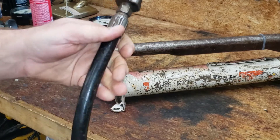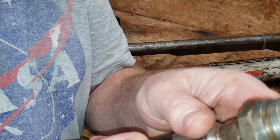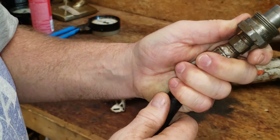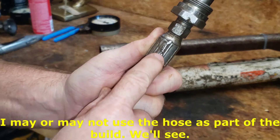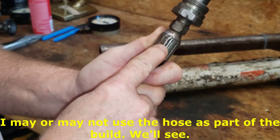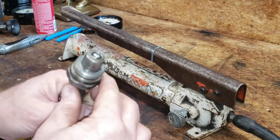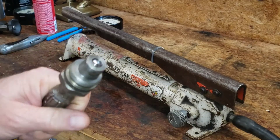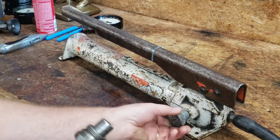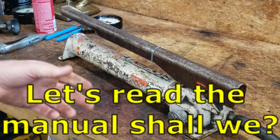This hydraulic line is really substantial. It says on the line: made in the USA, EF, 10,000 PSI max, and the part number looks like 9798. It also looks like there was a leak here and somebody brazed it — or maybe somebody just bumped it with their welder. The hose looks like it's in pretty good condition, but there's some seepage at the hydraulic end — that's interesting. Let me tighten up this release valve.